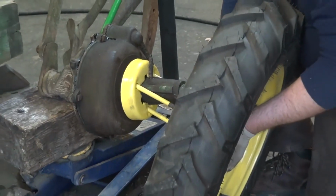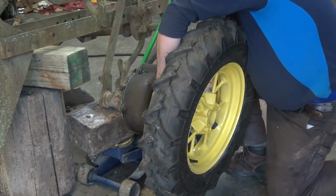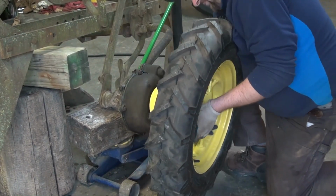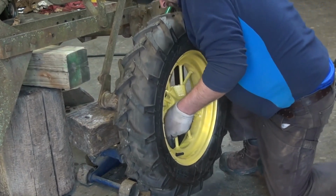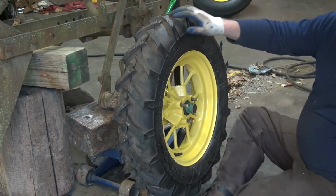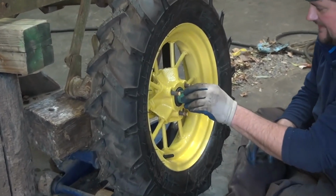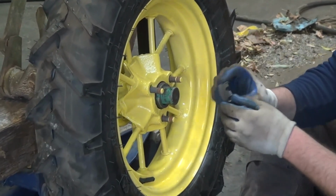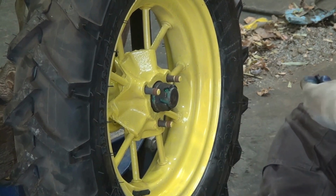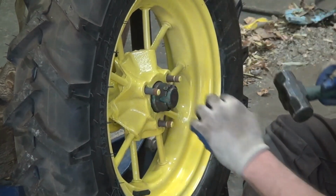So taking great care to do that, and to start the bolts in the proper spot, sort of a three-handed operation. I think all my bolts are in position, and then it's simply sliding the wheel on. Now, from here, we will be putting our shim washers back into place like we had done earlier. We'll turn our adjusting collar so that it's in the position that we want. And we've got our drive pin, or our little keeper pin, just nice and snug there.